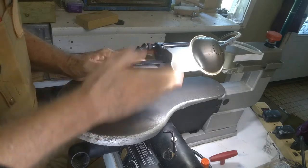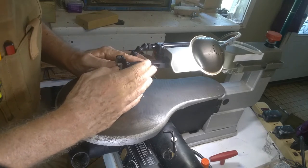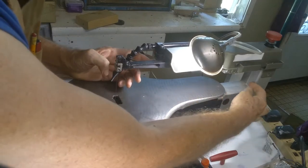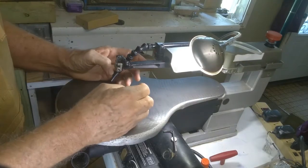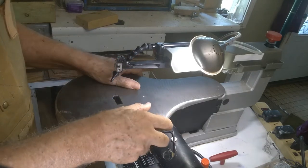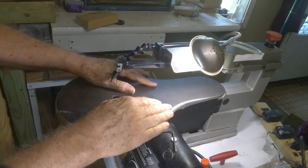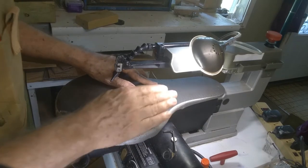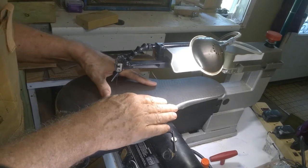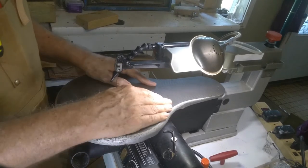The parallel arm saw is lower end — they're good saws, but those other features are much more desirable. The other feature you need to be aware of is the throat depth. This one is a 16 inch, which means from here to the blade is 16 inches. They come in different sizes — generally we look at 16s and 20s, but there are also 18 and 21 inch saws and even larger. Most of the mid-range saws are 20 inch — they're very good saws and usually double parallel linked.